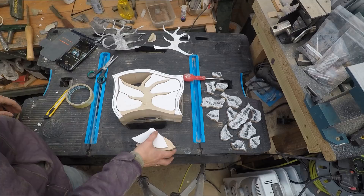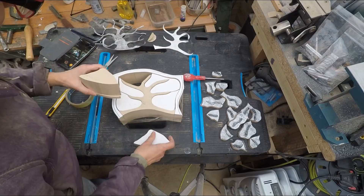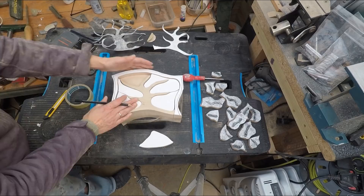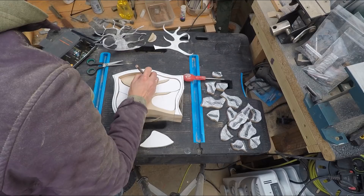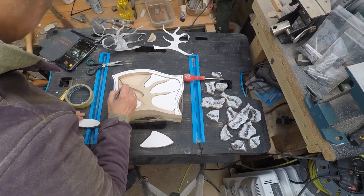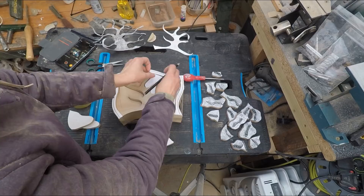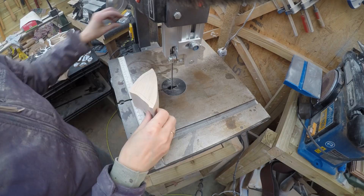That's the fronts and backs cut off. I'm going to place them into this now - that's what I was just doing - ready to draw the outline for the drawers. Obviously this is the bottom and this is the top. I just do a little line in there as a reminder of where the opening of the box needs to be, so when I cut out I don't get confused on the top side. Then I'll go to the bandsaw and cut the inner boxes out.